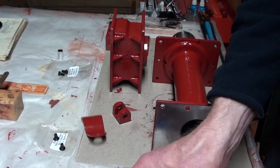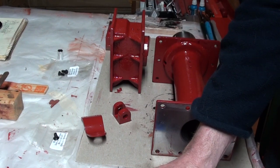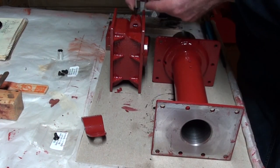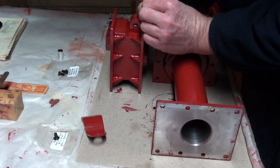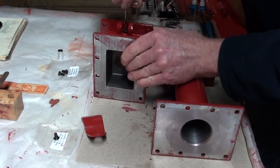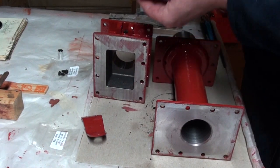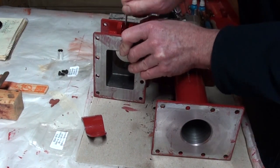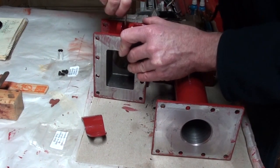The spring hanger bracket was fastened to the second shaft axle box. The water gauge bracket was attached to the second shaft tube. Study the instructions and diagrams to ensure correct orientation of all parts. After this, the second shaft tube and box were bolted together.